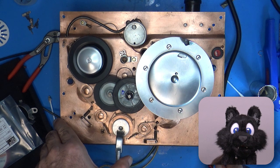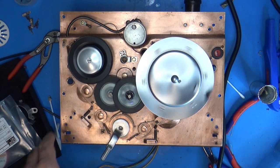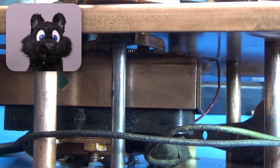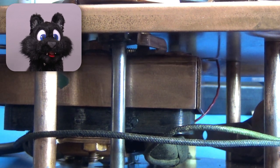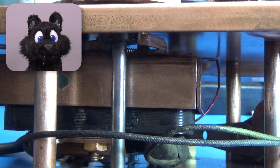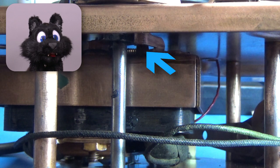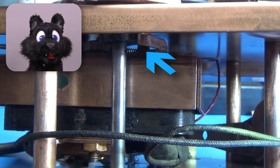Let's have a quick rundown of how things connect. The motor is sitting in the base plate with a teeter-totter arrangement held in place by two springs. This allows it to be tilted over to the rewind or play position with a cam that pushes against the spring-loaded lever.